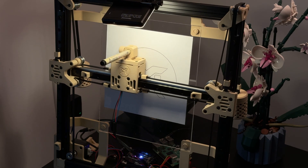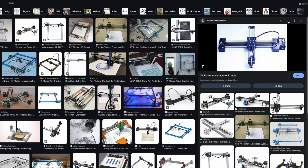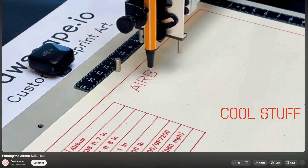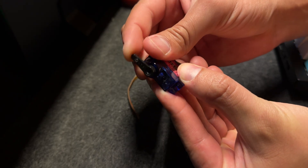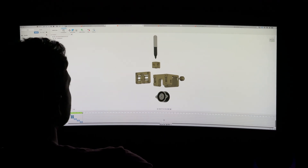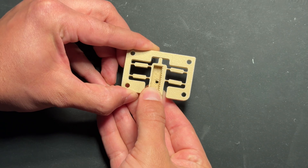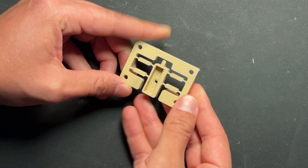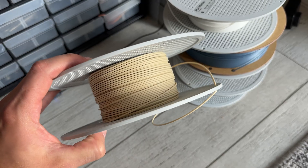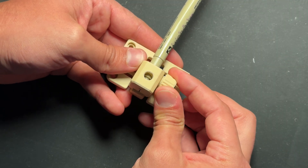To get this thing to draw, I needed to solve a different kind of challenge. Remember, the main goal here was silence. Most XY plotters or other drawing machines would typically use solenoids or servo motors to move a pen up and down. The problem is that solenoids make a sharp, clicky sound every time they actuate, and small-geared servos tend to whine while they move. Neither of those was going to work for the vibe I was going for, so I created a custom compliant mechanism paired with a smaller pancake stepper motor. Compliant mechanisms are neat because they allow for motion within a single, solid piece — instead of relying on hinges or joints, they flex, using the material itself to create controlled movement. I printed it in PLA, which probably isn't the best material choice, but it's what I had on hand and I honestly was not looking to spend any more money.